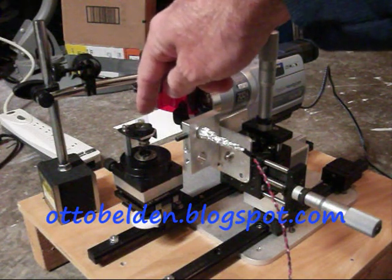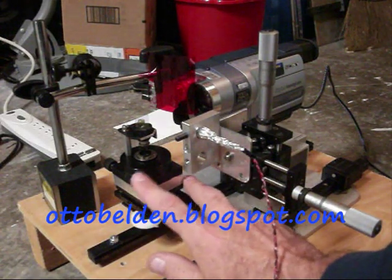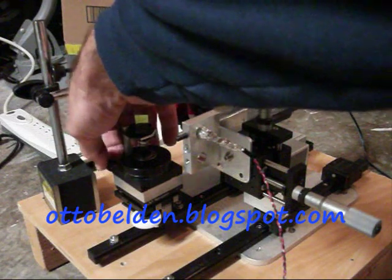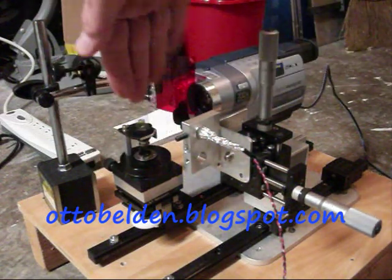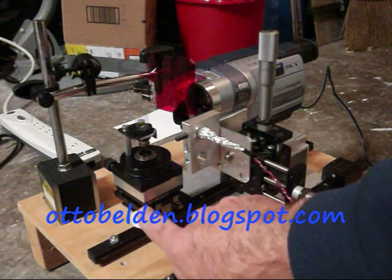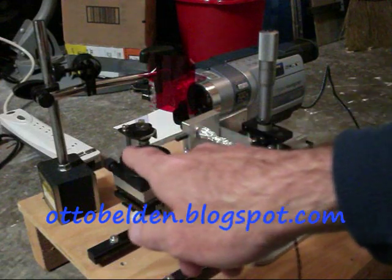It's a very small piece of glass, optically coated. Underneath it is a rotational assembly. I can adjust this knob over here to rotate the mirror side to side, and then it's on a Newport stage kinematic mount that I can adjust the pan and tilt of the mirror.